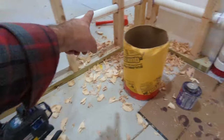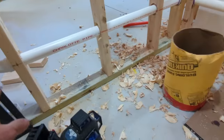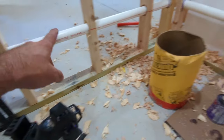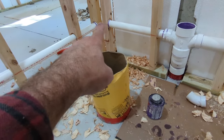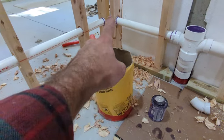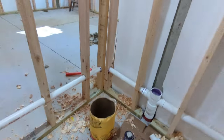That pencil line was done. I set the laser, which is level from the center line of this, and then I find out how far away I am, and then I measure up 1/4 of an inch per foot, and I make a mark, which is what that is. And then, like at the corner, I decide whatever height I'm at, and I do the hole and the marking all at the same elevation in the corner. But anyway, I pull and snap a line from here, pull and snap a line down to there, and then push over onto the side, mark, and drill all the holes.